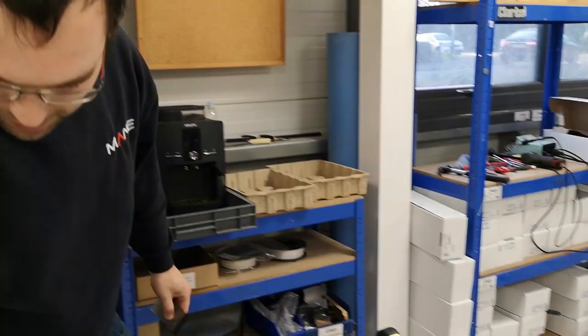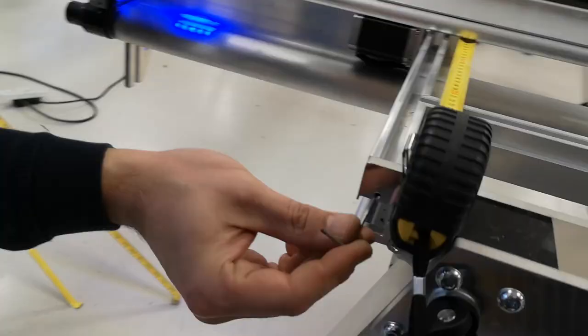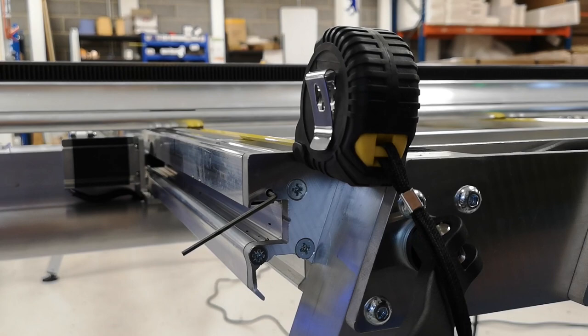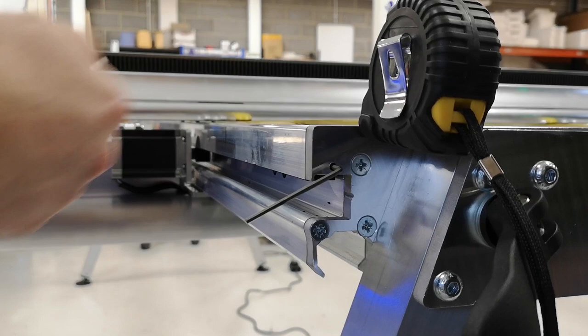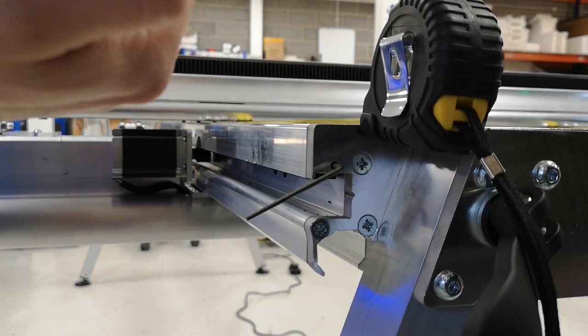As mentioned earlier, use the Allen key. At the end of the bench on the end plate, there's a tiny hole — inside there is a two and a half millimeter Allen key hole. Depending on which way you are, you're either over or under the measurement. In my case I'm over, so I want to screw the grub screw in. To move the X beam towards the home end, you need to screw in. To move it away from the home end, you need to unscrew.